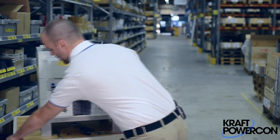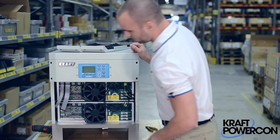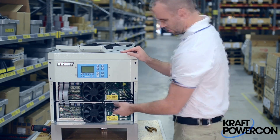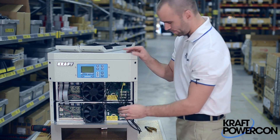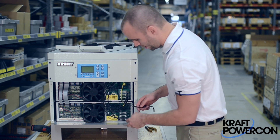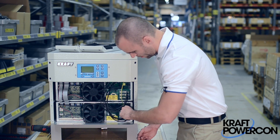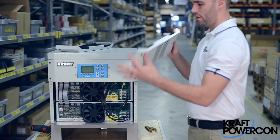So the back is reassembled. Move to the front. We're going to connect the communication cables first — make sure they're connected firmly. I'm going to pull out the three-phase cables from the little tuck-in spot and connect the earth cable first, the ground cable. Then we're going to connect the three-phase cables one after another — you're going to hear a little click sound. You want to pull at them just a little bit to make sure they're sitting firmly.